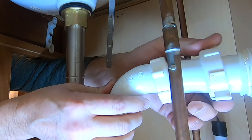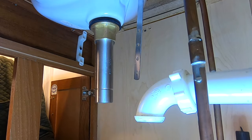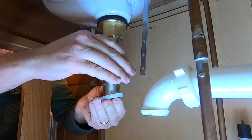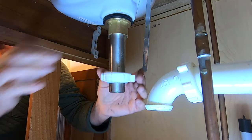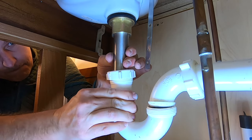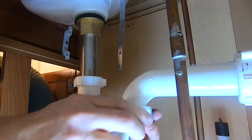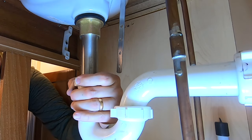This is going to drain much much better. We grabbed the plastic washer off the old drain pipe. First put the cap with the screw cap on, then the plastic washer — that's just going to make a tight seal as it screws down onto the P-trap. It goes right back the way we originally took it off, and if there are any leaks you'll see them right here; it's just a matter of going back and re-tightening, making sure it's on square.